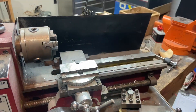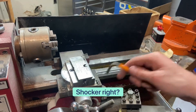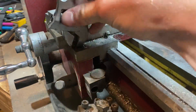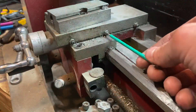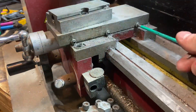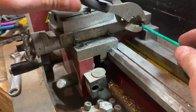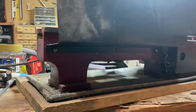Unfortunately the pulley isn't really built to be used this way, so it actually doesn't fit very well. There's a rubber gasket on the lead screw support that the pulley kind of rubs against, and so even though it locks in place effectively, it has a little bit of give because it's referencing against rubber not steel. There's also a ton of friction because you've just got compressed rubber that you're dragging every single time you rotate the lead screw.